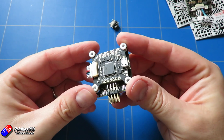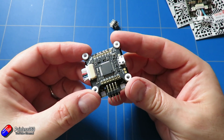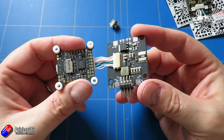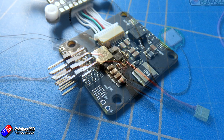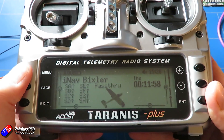There's an extra bit of wiring I'm going to do to make the whole assembly plug and play — so I can plug in not only the servos, but also the GPS, the video transmitter, and the camera for the front. I'm also going to add a couple of extra things: even though there are only four outputs on the wing power board, you can have an extra two servos out, and I'd like to add those as a pan and tilt control for an FPV gimbal at the front of the Bixler.